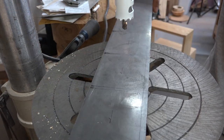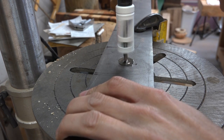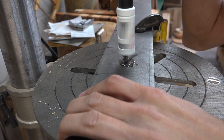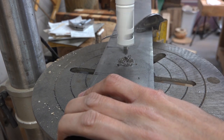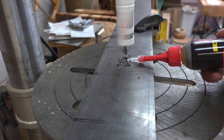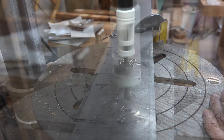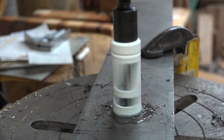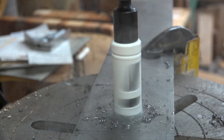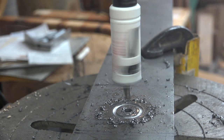The hole where the pin goes through is going to be drilled to 15/16 inch. There are plenty of ways to drill holes in steel. I decided to go with an inexpensive option and use a hole saw. I used a hole saw to drill one inch diameter holes in half inch steel when I built the arch mounts for the trailer, and that worked out great. I took my time drilling the holes, keeping the bit well lubricated. It took about 10 minutes to drill each hole, but I had to stop after every other hole to let my drill press cool down. This is easily more work than it's ever done.